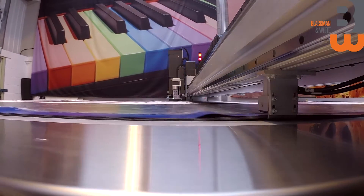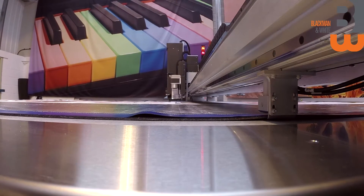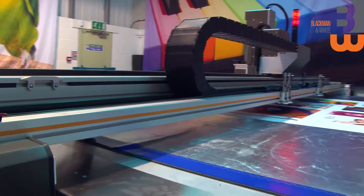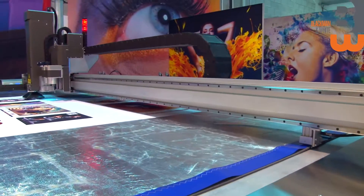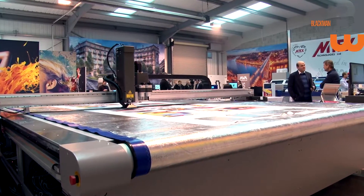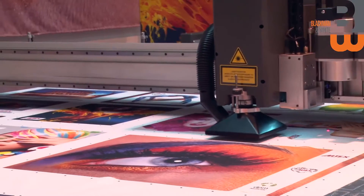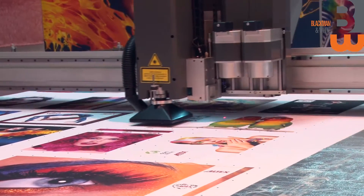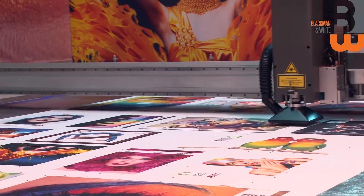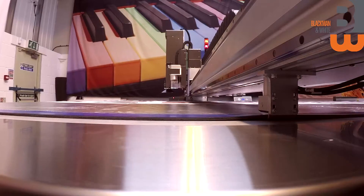Now you can see the laser running, generating a cut profile and neatly cutting the parts into exactly the right rectangular shape based on the location of those registration marks. This machine is 3.2 meters wide and 3.2 meters long — mostly used because of the American format of 10 feet — and can be used for several materials. The laser is a 100-watt laser capable of cutting all textile material at speeds of around 800 millimeters per second. The machine is also capable of cutting rigid material with both the laser and a knife and routing tool.